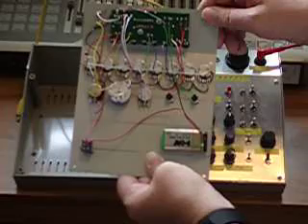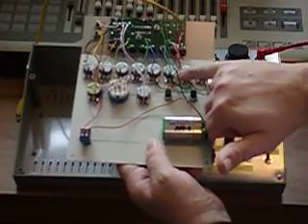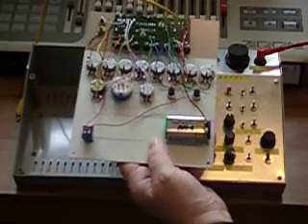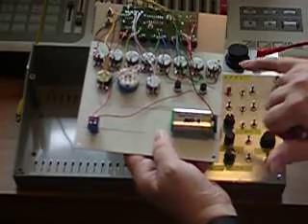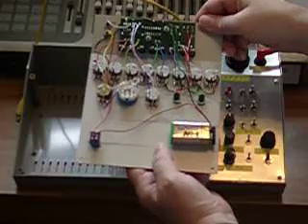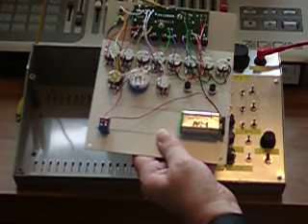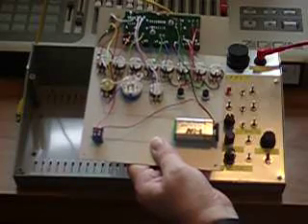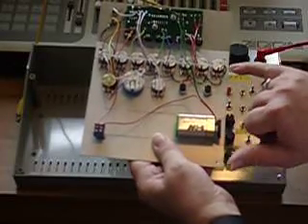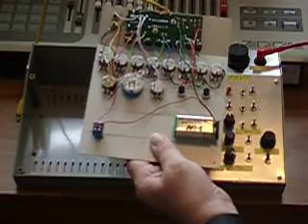These are connected together via eight signal diodes, wired one to each potentiometer centre pin. The anodes — the end that doesn't have an indicator band on it — go to the potentiometer, and all the cathodes are wired together onto a single bus. Any signal diodes can be used here. Silicon 1N914 or 1N4148 types can be used, but these will produce something of a dead spot in the voltages. Better still, use a silicon Schottky diode in each case, or alternatively, as I have done, germanium diodes.